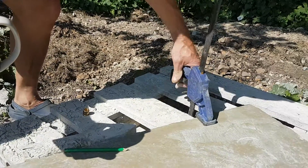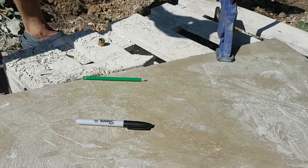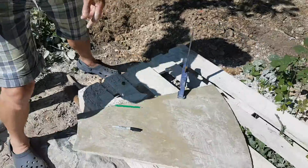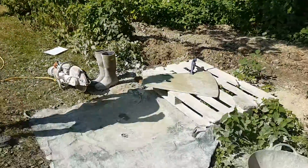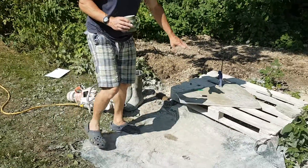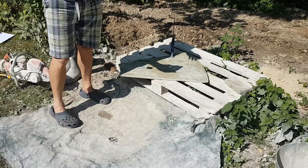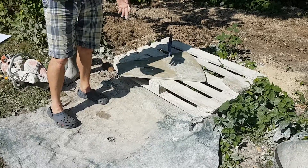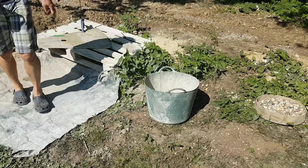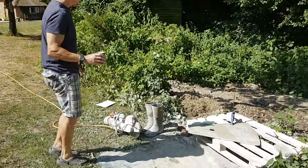I also additionally support it with just a simple clamp, so it's all held quite firm. Health and safety experts may say that's completely insufficient, but it worked for me. I've done quite a few hundred cuts now and haven't had a problem with that system. I run the tarpaulin underneath the pallet — there's a lot of water involved, and there are a lot of chippings that fall on there. You don't want to be walking around on them, so I empty them occasionally into a bucket. It keeps things tidy and probably a bit safer because you're not tripping over all the offcuts.